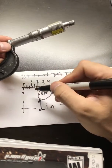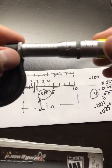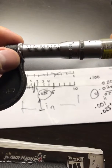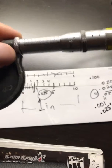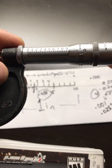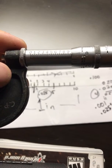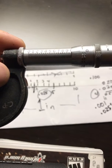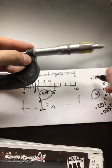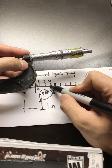If this was 25 thousandths, a second revolution lands on 50 thousandths — the bigger line at the halfway mark. A third revolution brings you to 75 thousandths. A fourth complete revolution gives you 100 thousandths, which moves you from one major division line to the next on the horizontal scale — because you've gone through four subdivisions.